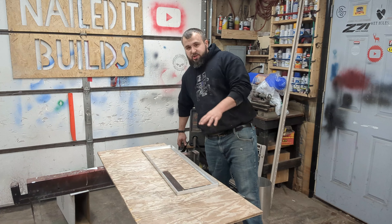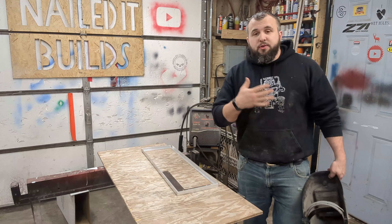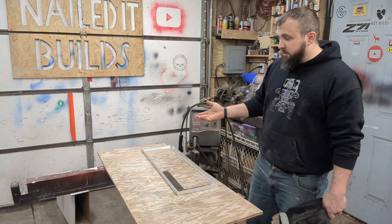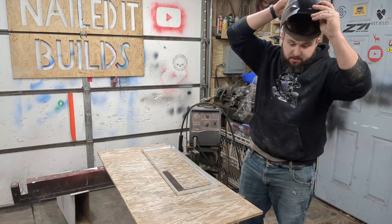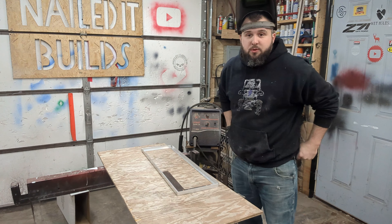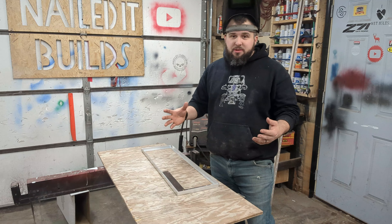So we're going to attempt to just tack this thing into place. I don't have a fixture table. It'd be really nice if I did. If you think it's important to do metal work on a completely flat fixture table and not just a piece of plywood on sawhorses, feel free to subscribe and binge watch a bunch of videos — maybe one day I'll afford one. So I put a square in there to help keep it square, and I'm just going to try to lightly tack it before I melt everything.